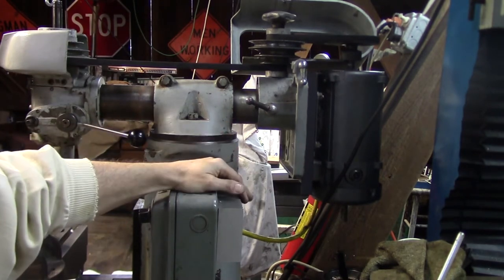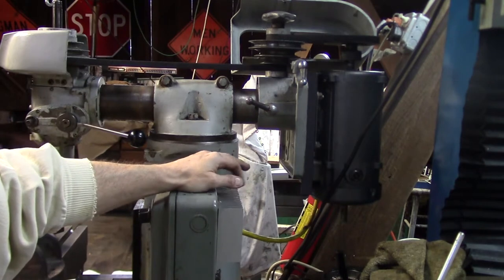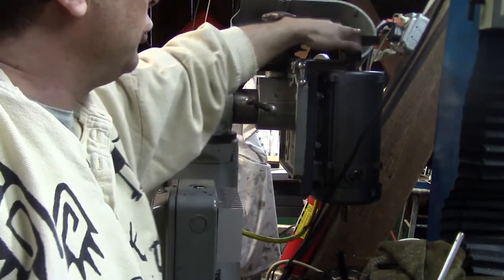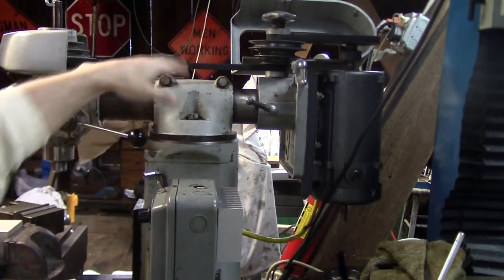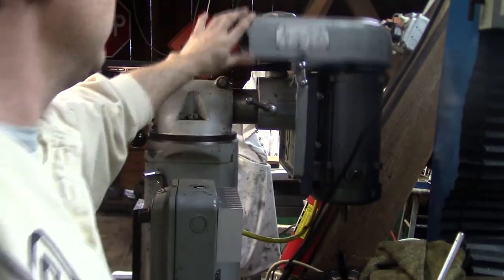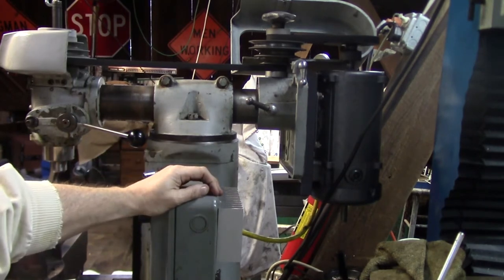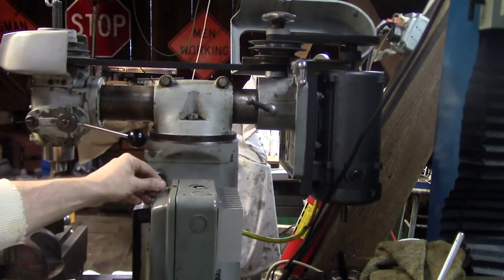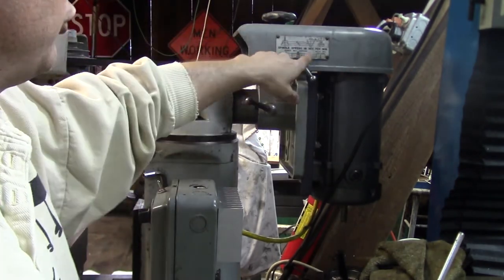It got to be really tiresome, so last year a friend offered me a heavy-duty treadmill from a professional gym that had a one-and-a-half horsepower DC Baldor motor on it. I took the motor out, used the factory pulley setup, and put a variable speed drive on it. Now with the pulleys in the position that nominally gives you 1,000 RPM with a 1,725 RPM motor, I can just dial in from about 250 RPM right up to almost 2,000 RPM without changing any belts. I can also fire it in reverse.